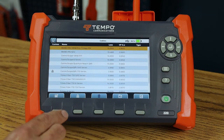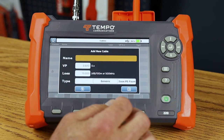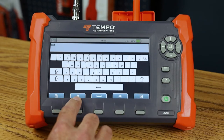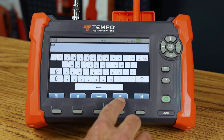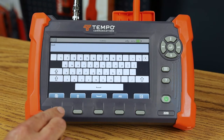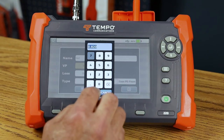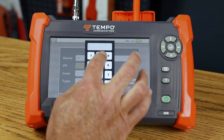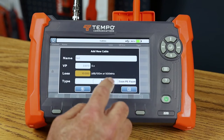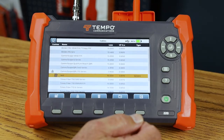To create a new cable, I press F1 or touch the menu. I'm asked to enter new cable information — I'll call this 'TEST'. Quick options include capital characters, space bar, and alternate to switch focus between the name field and keypad. I save the cable name, then set a VP — the TV220E allows VP from 0.3 to 1, so I'll enter 0.87. I also enter a loss factor of 10, and select generic type, though foam core, air core, and solid core options are available. Save — and now that cable is saved.